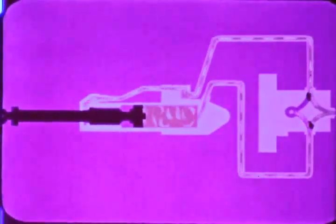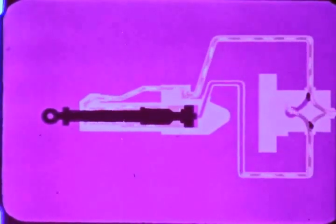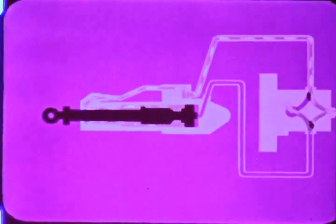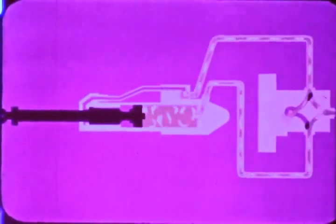As the air moves into the cylinder, it pushes the piston to retract. The air on the opposite side is forced through a restrictor valve. This restricted flow of air allows the piston to move at an even, controlled rate. When the piston is moved to the extend position, the snubbing air is on the opposite side of the cylinder. As it is pushed through the restrictor valve by the counter movement of the piston, it balances the force, and the piston comes to a controlled stop.